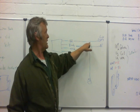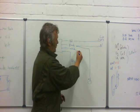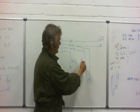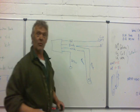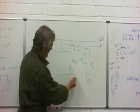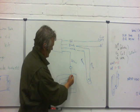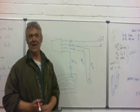This one is brown in the UK — you connect the brown one up to the red one. Now this white wire connects to the other side of your lamp, and that connects to the brown wire of the lamp. And that's how you wire it up. The yellow one is what connects to the touch pad. So if we connect that to our painted square and we touch our painted square, then that lamp will light.